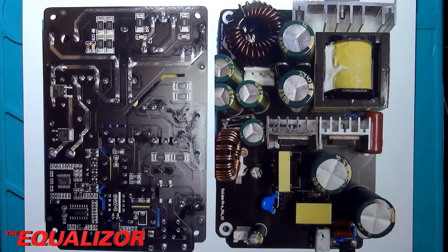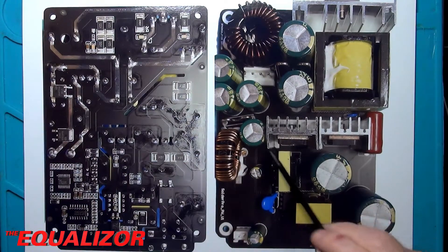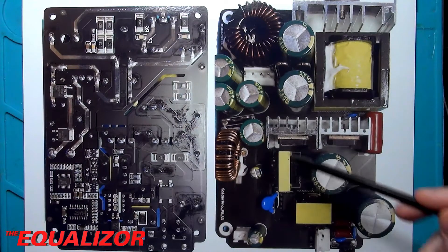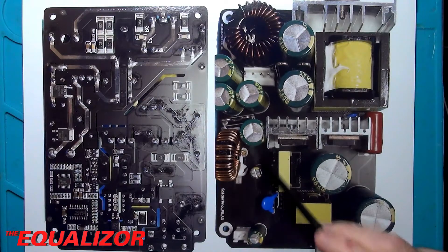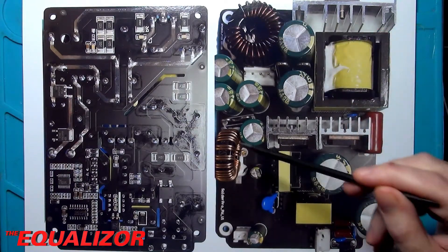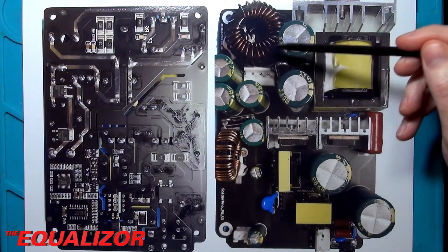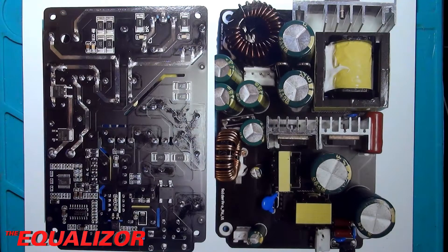I really like the look of this power supply. I like the fact that it's got the matte solder mask, which when you order from somewhere like PCBway is really expensive compared to normal shiny stuff. The soldering seems excellent — it seems like a really nicely put together supply. The only thing I don't like quite as much is there's this capacitor which is right next to this heat sink, which for some reason seems to have been bent around a little bit. That heat sink's probably going to get quite hot, and that means that cap's going to get quite hot as well. The caps on here do seem to be rated for 105°C, but it would be nice to not have this concentrated heat source heating up that capacitor. And look at these lovely chunky inductors here — that one is for the 12 volt switching supply, and this one is just part of the filter for the 24 volt output. And that's about it for that circuit board.